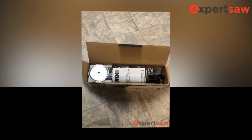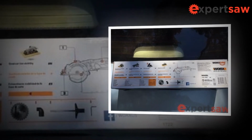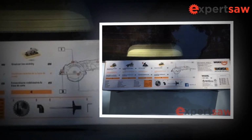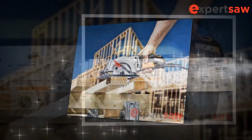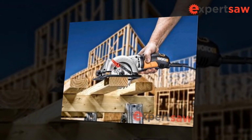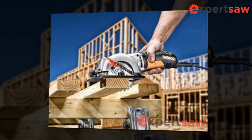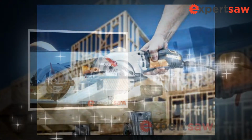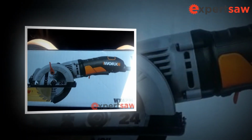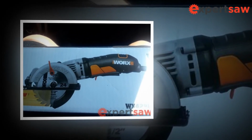C. The lower guard can be retracted manually only for special cuts, such as plunge cuts and compound cuts. Lift the lower guard by pulling on the handle. As soon as the blade enters the material, the lower guard must be released. For all other cuts, the lower guard should work automatically. D. Always make sure the lower guard covers the blade before placing the saw on the bench or the floor. An unprotected, coasting blade will cause the saw to walk backward, cutting everything in its path. Be aware of the time it takes for the blade to stop after releasing the switch.